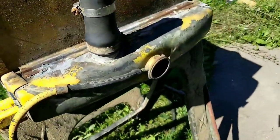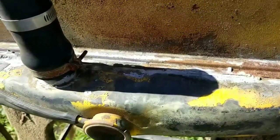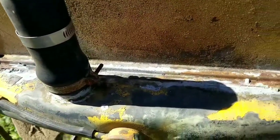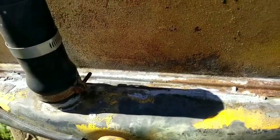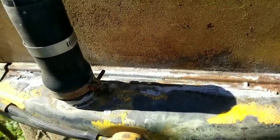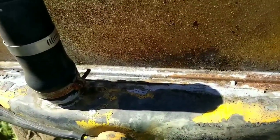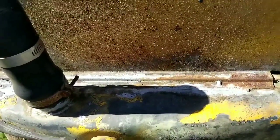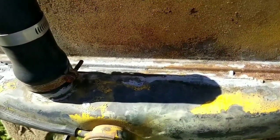I previously repaired this tank, probably in the unapproved way, which is just bridging the joint. And of course, if you bridge a joint, you can imagine over time the debris in the joint will continue to corrode and rot, and you'll have basically rust jacking. Still rust, even though it's not iron. You'll have rust jacking push that solder apart and cause failure again.